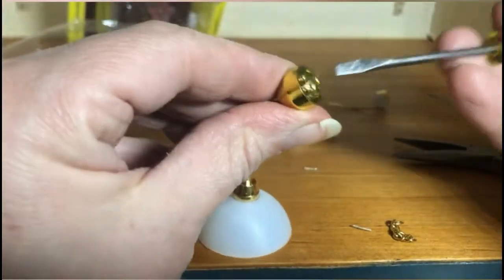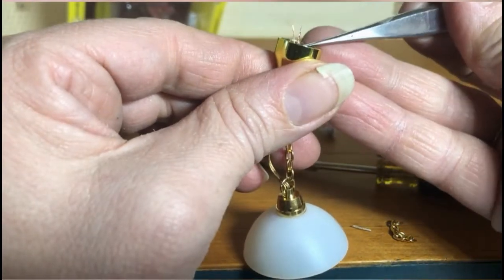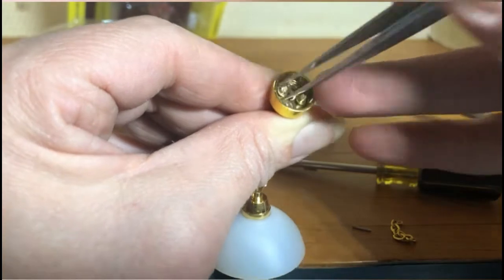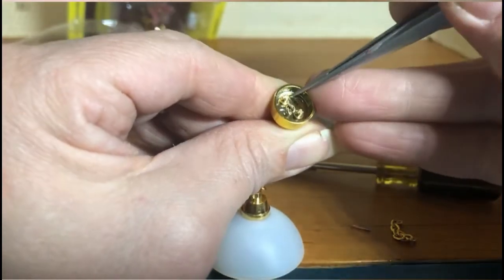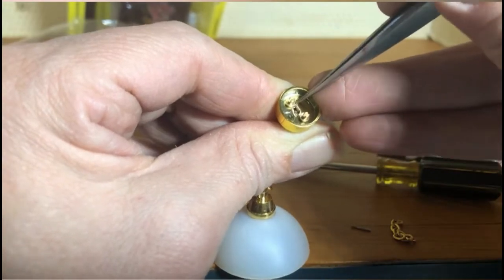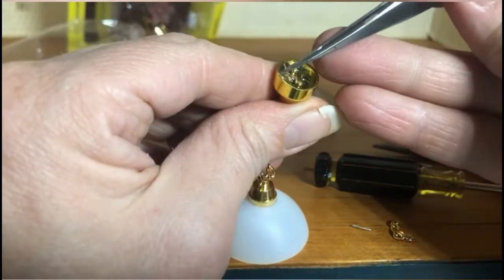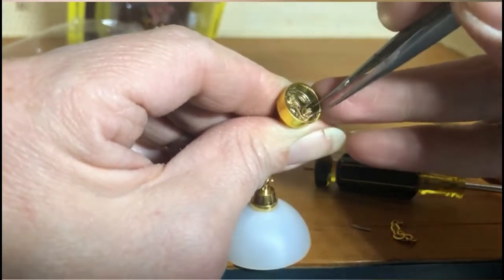This is lifted up a little so we can get the wire around the threads. I'm going to use my tweezers — grab one of the wires, push it down, and get it underneath the plate. I want it where the threads are, hiding underneath the plate. Tuck it there — around the threads of the screw, completely concealed under there. Go ahead and tighten it up so nothing pulls out. We're doing the same with the other one, making sure there's no exposed wire, because if any wire touches itself in the middle that would cause a short.